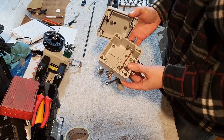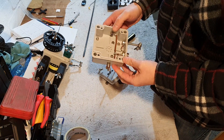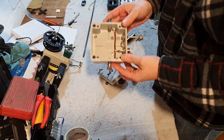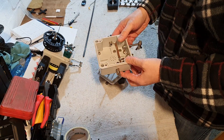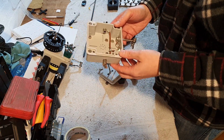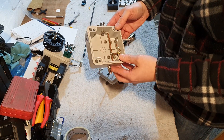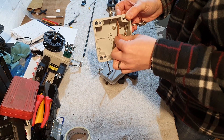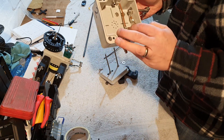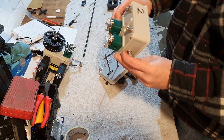It's quite a simple thing but I'm quite pleased with how it's turned out — it really is heavy duty, absolutely solid. If you wanted to you could actually put a 1:1 choke balun in here. I was running two of these last week with a bit of power and had absolutely no issues at all, so it's not always necessary but you could easily put a choke on here — or maybe a GM3SEK; I've got a couple of those I could use. The wire I've used inside is actually house wire left over from wiring the garage. It's quite thick — maybe 12 gauge something like that — so it's going to handle a lot of power if you wanted.